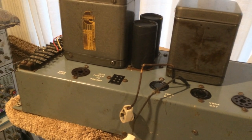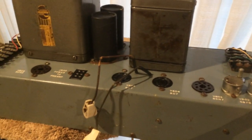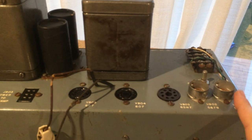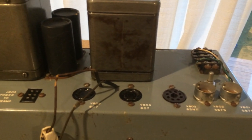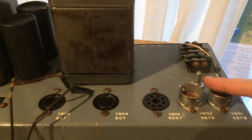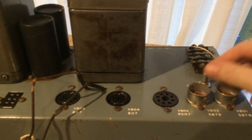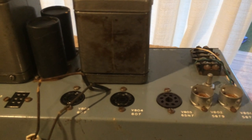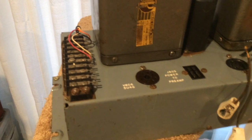As a theater amp these were the best sound I ever heard in a movie theater. In this format you cannot play them as-is, partially because they have the tape level input, so you would need to get rid of one of these tubes. If you have only one tube, it's still plenty of gain to use a preamp level signal, and it has an input pot — a 250k audio pot — that acts as a volume control. You need to put in an RCA jack, speaker binding posts, and an outlet for AC as well.